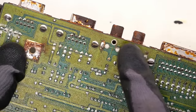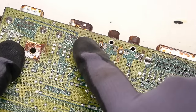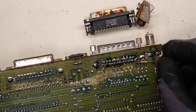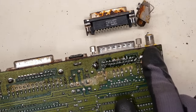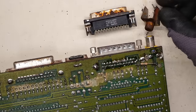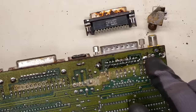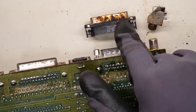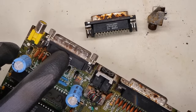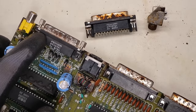Just look at the audio output jacks — and look at the joystick port, there's an actual rust hole. That is hilarious. Alright, there we have it — new RCA jack for the composite video and a new RGB connector has been added. The old RCA jack was really difficult to get out; the corrosion was making it very difficult to solder. The new one went in pretty easily. The quote-unquote new RGB connector does have a little bit of rust on the top part, but the pin area is completely fine.